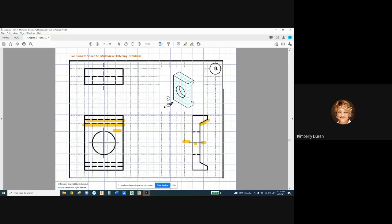We have to have the front view because of the hole, and it gives us the shape of the part. The side view gives us the shape of the taper, the depth, and this cut. The top view is important to understand this. Number one, this should not go all the way through — the hole goes from here through here to here, just like it does right here. This doesn't go all the way through the end of that part.